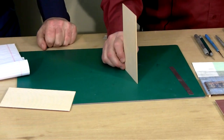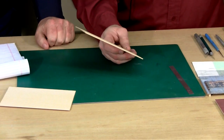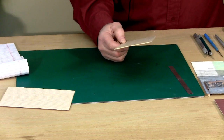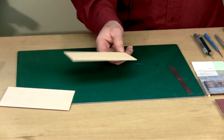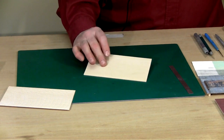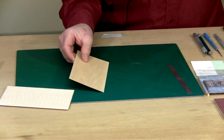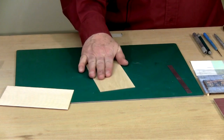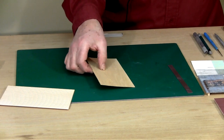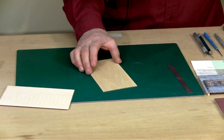We talked in the last bit, if you did happen to tune into the last bit, about why we do this distressing of the wood. But we're not going to deal with why we do it, we're going to deal with how we do it. I like to do it when it's flat. I'll distress my wood long before I put my bracing on it. That way I'm working on a nice flat surface. I don't have to worry about pressing too hard and splitting the wood and things like that.